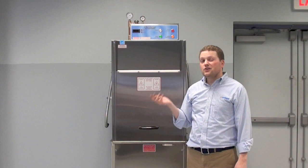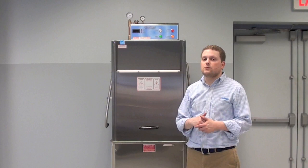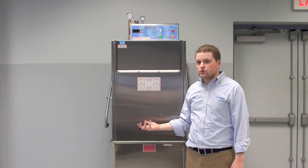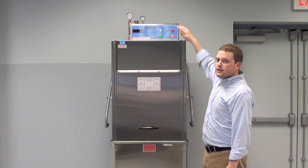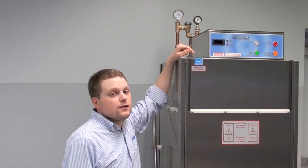It is important not to let the pump motor run for more than twenty minutes, as this could cause the pump motor to burn out. We recommend doing it for five to ten minutes, then checking the contents of the machine. If it is still dirty, do it for another five to ten minutes — repeat as necessary, but allow the pump motor some time to cool off. When you are all done, make sure the deliming cycle is off, hit the power button to turn off the machine, and drain the contents of the lime solution and dirty water. Pulling open the drain will allow all that to leave the machine. When you're ready to wash dishes again, close the drain, turn it back on, allow it to refill and heat for about five to ten minutes, and now you are ready to go.